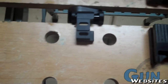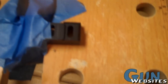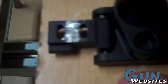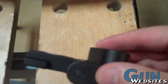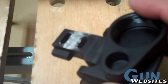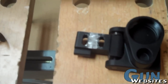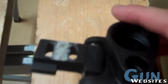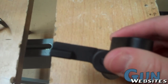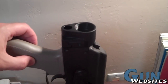It's all chalked up, ready to grind. I'm going to have it masked off just to keep the metal flakes from getting inside the mechanism. Using a cutoff wheel and a little grinder wheel — ground it flat. I'll touch that up with a little bit of paint first, just to environmentally seal it, because you're going to have aluminum from this block going onto the steel trunnion. Those are dissimilar metals and they liken themselves to corrosion. So I'll paint this black before attaching it, but I'm going to make sure with a fit check that it works.